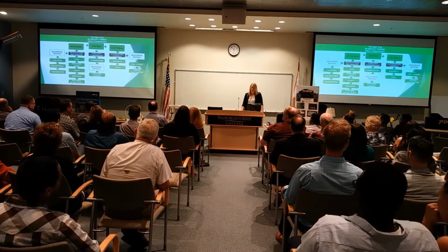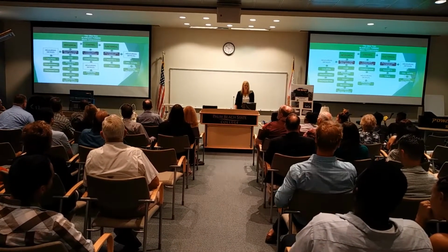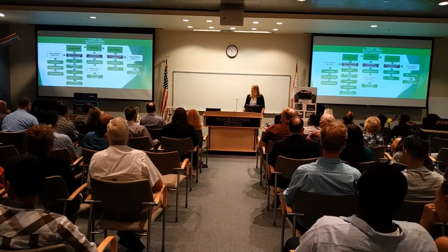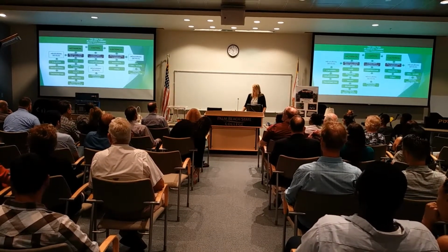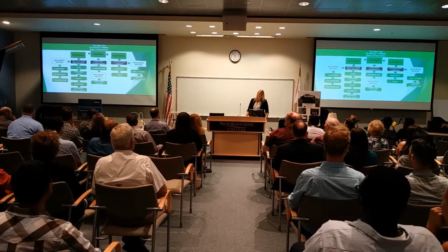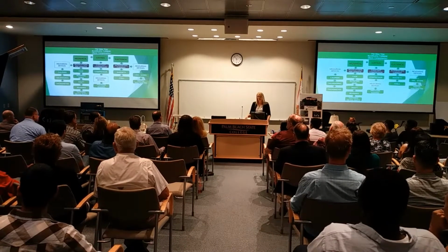Here, this is kind of the idea tree that I had for my bladeless turbine. I realized that I had a control, which was the pressure system, and that I would have to supply a certain amount of pressure through an air compressor. So my air compressor had to be able to go up to a higher pressure gradient. I had to find a really efficient compressor, which I did. I had a 150 PSI compressor. Some of the measuring devices I would use were pressure gauges on a compressor, and I needed a pressure gauge that I could control the pressure inlet and outlet so I could take my data.